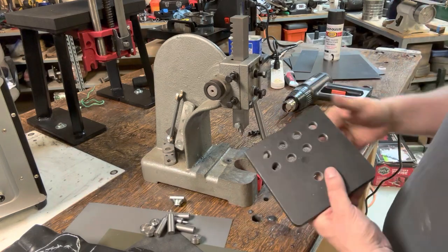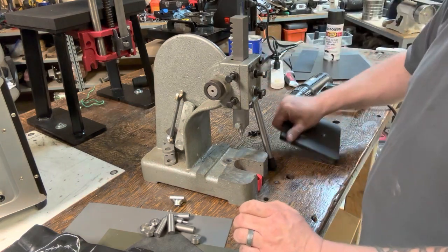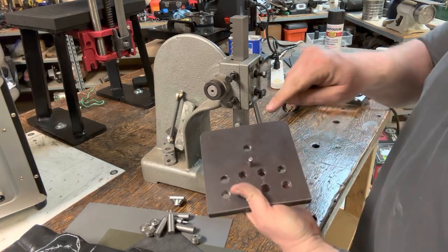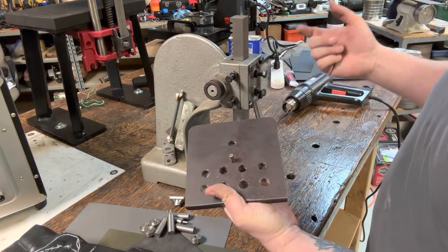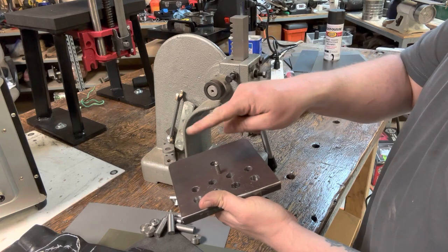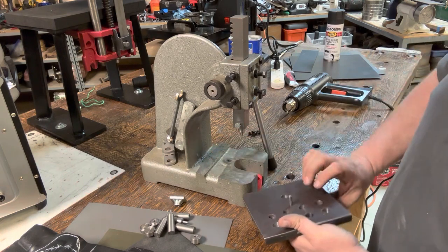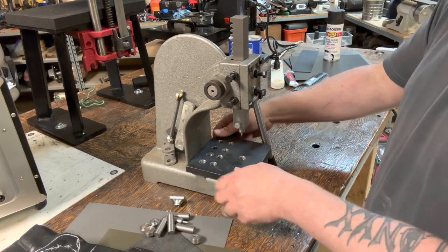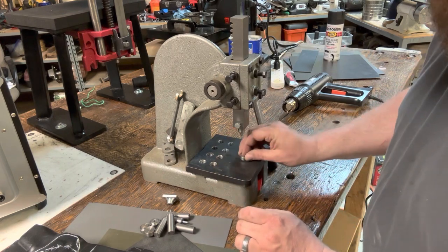Okay, this plate is just another piece of the same type of stuff as what I got over here, this half inch plate. This was just a piece of that same industrial offcuts, okay? I drilled a slightly undersized quarter inch hole and then wedged a quarter inch piece of, well, what I use it for is pins for knife stock, but it's just a piece of stainless quarter inch rod, okay? It's in the exact point where the spinning mechanism that used to be here was. So now when I put this down and it finds its little hole, it sits in there and doesn't move at all. So this does not spin. So that's solid. And then these can be moved to wherever because they're all the same length.